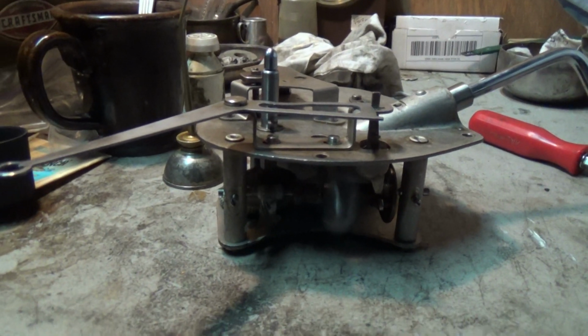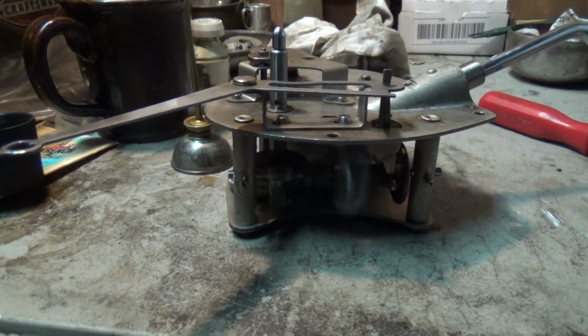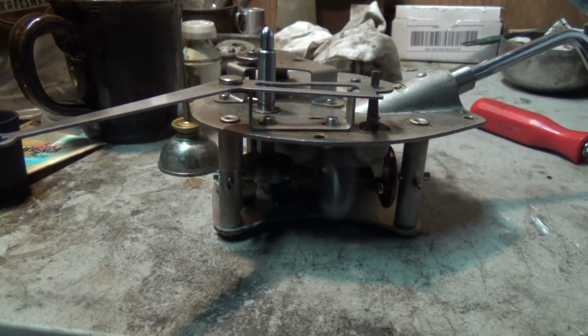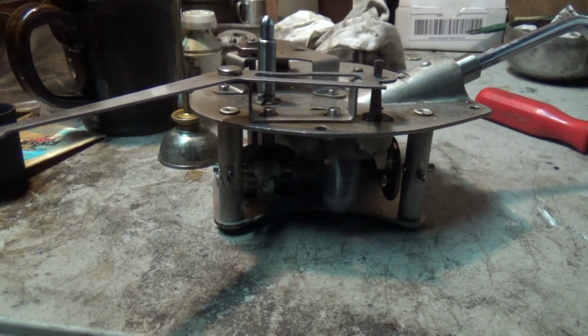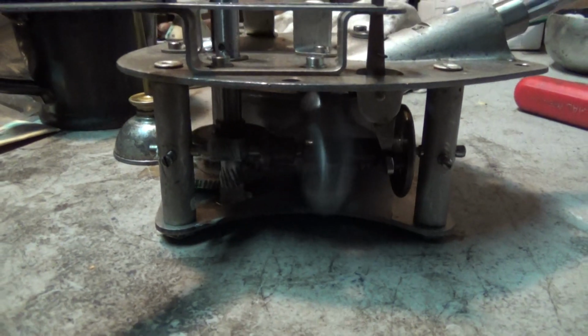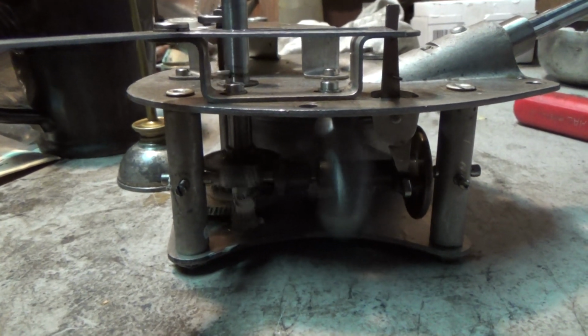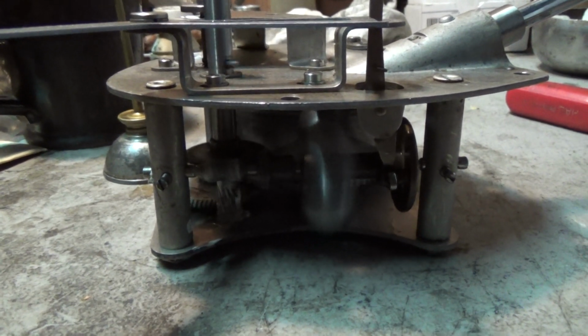And there we go. The HMV-102 with the steamship stickers motor is once again alive. We fixed the problem with the governor, which was actually 2 loose screws, not just one. That's why you always check. And now everything's back together and functioning.